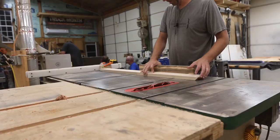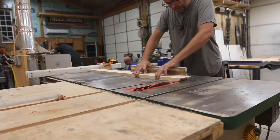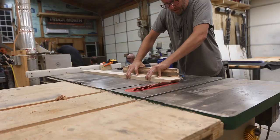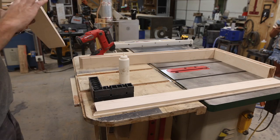It's really simple — just cut off one side, then be sure to flip it over to do the other side. This side required a little bit more setup. I did not want anything to bind against the blade, so I used a spacer to start my material on, but by the time the blade would be cutting it, there would be nothing touching on the fence side of my piece. This would allow the piece to not bind and catch on the blade.